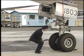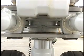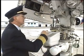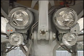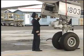Then check the condition of the nose gear wheels and tires. Be sure that the shock strut has the proper extension — at least two inches of polished area should be visible. Check the condition of the steering actuators and linkage and make sure the towing lever is in its normal position. Verify that the parking brake on and set lights are lit. See that the taxi lights and nose landing gear lights are clean and unbroken. Verify that the nose landing gear doors are secure and not damaged. Examine the hydraulic cylinders and lines for fluid leaks. Make sure that the gear pin is not installed.